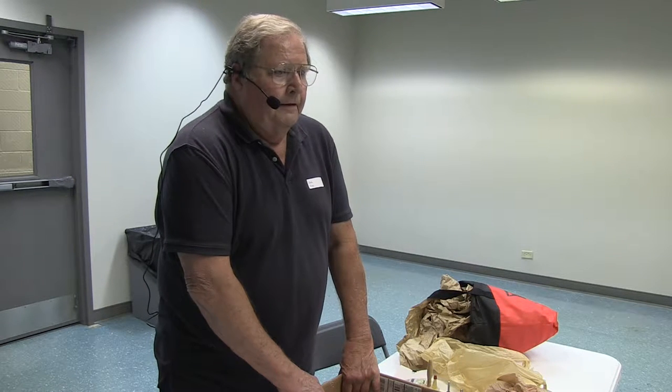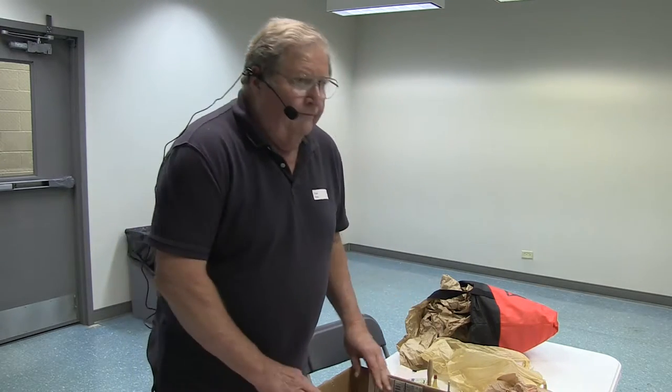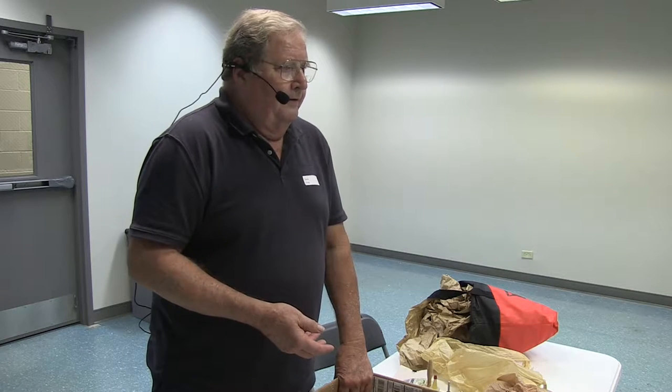Now, when I get sanding with the power locks, it's a rarity if I go past 150. I don't feel that they work as good as a soft one past that grit. I have done it. I've got finer ones at home. About the time I tell you I don't do it tomorrow, I will. Everything I'm telling you changes for the type of wood, maybe the shape of the bowl, your mood for the day, whatever. The only thing I'm telling you is just to keep it smooth, keep it as flat as you can, and make sure you get all the imperfections out.